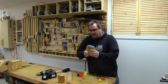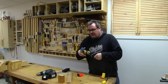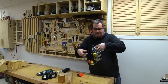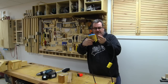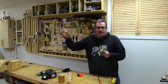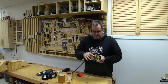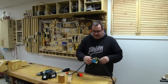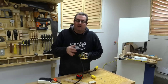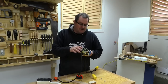There'll be more detail in the website article and there'll be a link to that in the description of this video. Basically the way this works is that this plugs into the wall, this one plugs into the saw, and this circuit is in between. What it does is the electricity as it goes through the cord goes through this bridge rectifier here and drops a little bit of voltage. That small amount of voltage is then amplified or stepped up with this transformer.